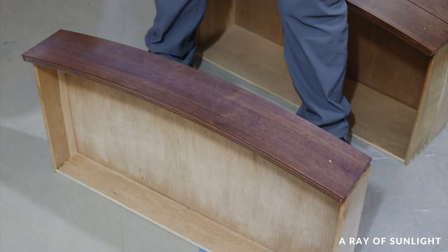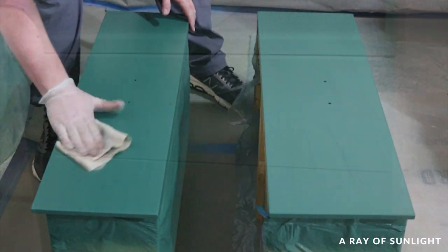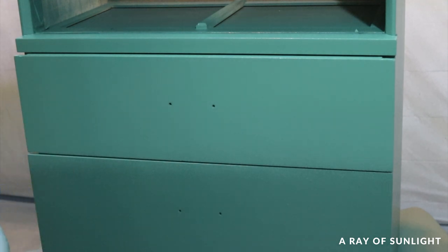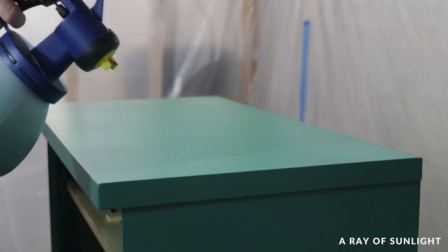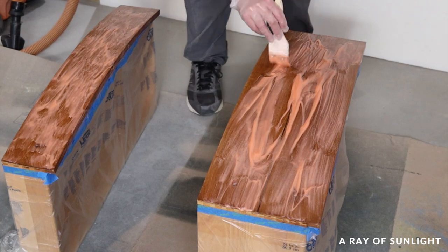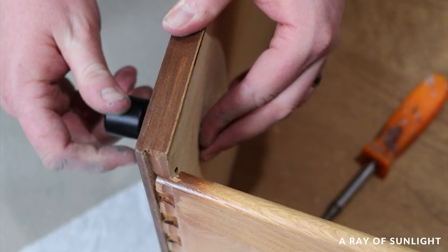The stained drawers were done and looked great, but I wasn't quite done. I went back to the dresser and lightly sanded those drawers one more time. After cleaning them off, Natalie gave me the idea to put them back into the dresser. Sprayed paint dries so much smoother when it's on a vertical surface — the sides always feel smoother than the top, and I guess that's another reason to spray with the drawers in. Then I sprayed one last coat on the top and the drawers. When all was said and done, we ended up with a total of five coats of paint, six coats of primer, one coat of stain, three coats of poly, and two coats of stripper in the beginning. After everything was dry, I put new hardware on. They matched up with the previous holes in the drawers, so we didn't even need to measure and drill new holes — and that's a win-win for me.